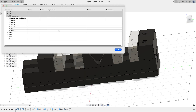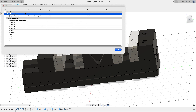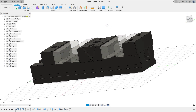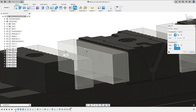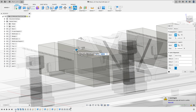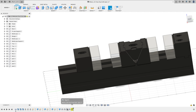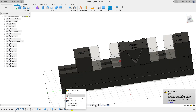Now I've got all the soft jaws attached. I need to set the spacing between them, but first I'll create parameters. I'll go to Modify > Change Parameters and create a user parameter called Front Jaw Spacing, set it to 0.5, and hit OK. I'll create one more called Rear Jaw Spacing, set it to 0.5, and hit OK. Then I'll add a joint — J for joint — between the jaw midpoints and drive it using the Front Jaw Spacing parameter.